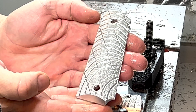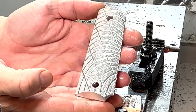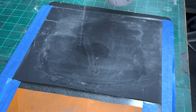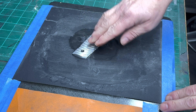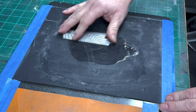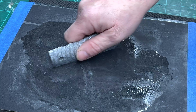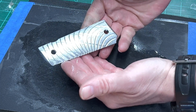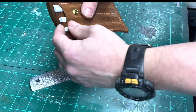I can tell from the analytics on YouTube that this is the point in the video where most of you leave, but before you do, please hit the subscribe button. My process for metal finishing consisted of starting with a 400 grit, moving to an 800 grit, and finishing with a 1500 grit. I then scrubbed the part with a Scotch-Brite pad until I was happy, and that took repeating the process at least three times. I also did a little stone work.